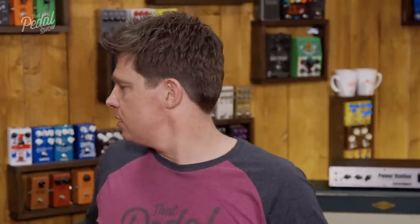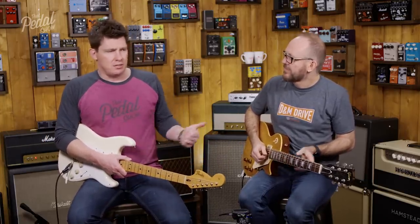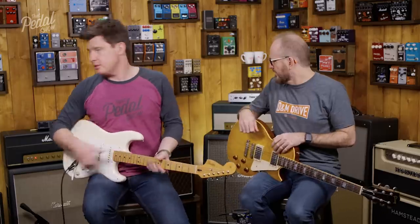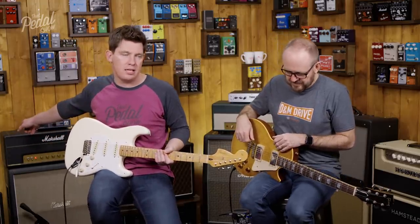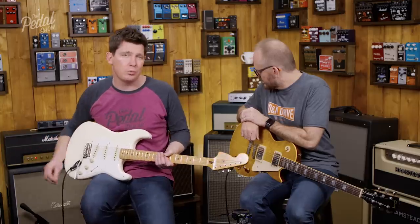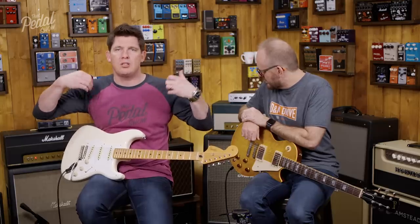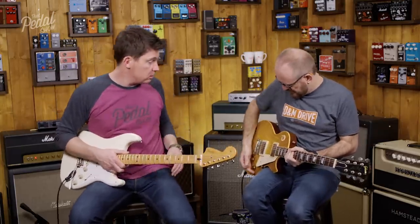We do have it through the Palmer Power Pad, which, depending on who you listen to, is either a reactive load attenuator or it's a completely resistive non-reactive load attenuator. Don't know. Sounds good to us. And it is down at stop number 4, so the amp is currently attenuated by 75%. Yep. And we've got the normal channel cranked pretty well, and a little bit on the high treble channel, not too much because it is very aggressive sounding. So we've set the Plexi up so that it is working. Sounds like this, in fact, if you can do that.